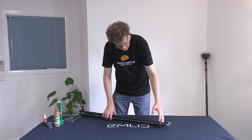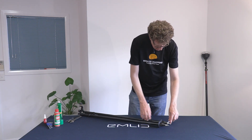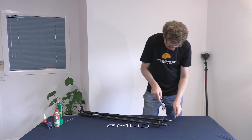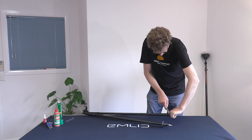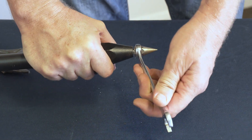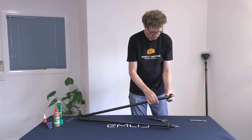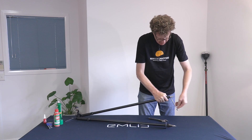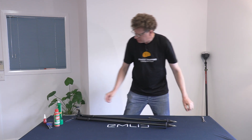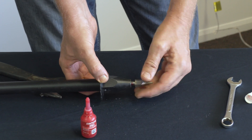The second area to watch is right at the other end of the legs — the little feet. The tips on the feet can become loose and work their way off, so you've got to keep an eye on those. The manufacturer of these bipods, Triangle, does a great job of keeping everything well attached, but you want to monitor these tips on your survey poles and bipods. It's a very fine thread that holds the tip against the foot. If they're getting loose, apply some Loctite before tightening all the way up — that will hold it firmly and stop it rattling loose.